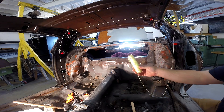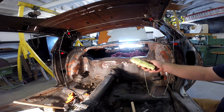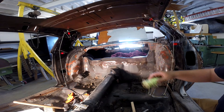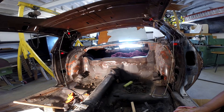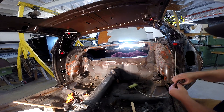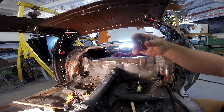What I've got here is a roll of high visibility string, just like Masons would use. You get this at Lowe's or Home Depot or hardware stores. Typically they'd tie a plumb bob to this and lay out a foundation for a house, but it's a nice strong cord. I've got that string in a position where I want the roll bar for this car to follow that pattern. On each end, I have the string tied to a magnet — just a round magnet.